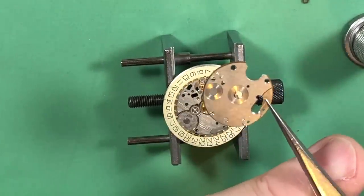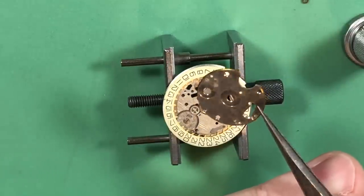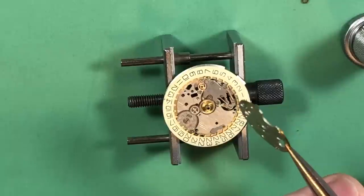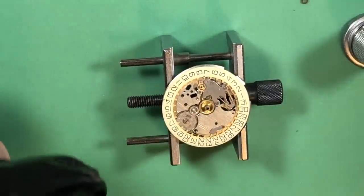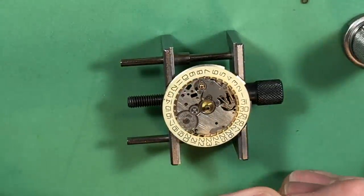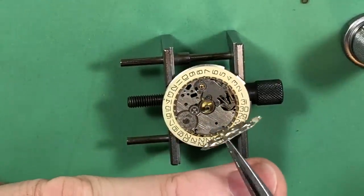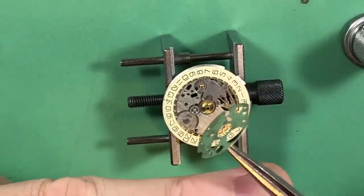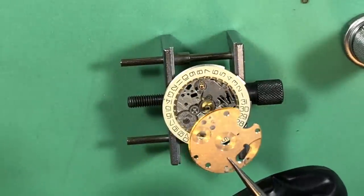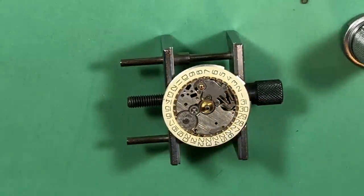Yeah, that's some pretty nice machining. Look at that. That's pretty clean. Just in terms of how well it's made, that's a big piece, and you've got that teeny tiny little edge up there. And unlike Seiko stuff, which for this same area is stamped. Like here, this is the date dial guard, very dirty one, for 7000 series, I think it's a 7006. You can see it's literally just stamped out of thin metal, kapunk. Whereas this one that the Russians made, look at that. It's a machined part. Huh. That's pretty cool. That's pretty neat.